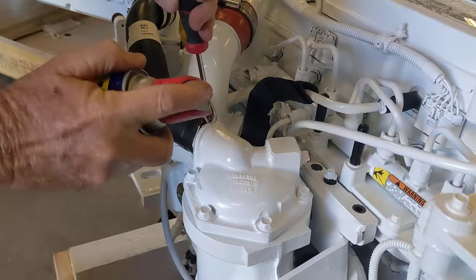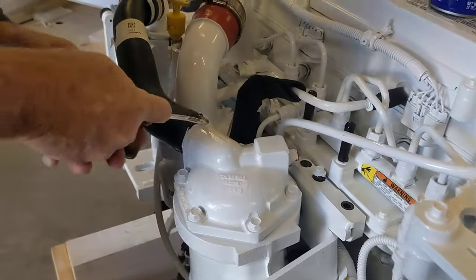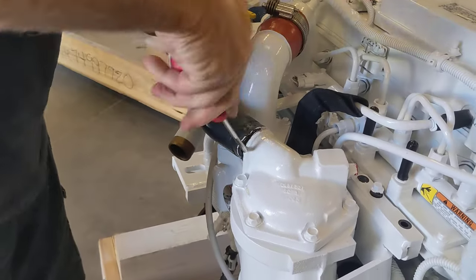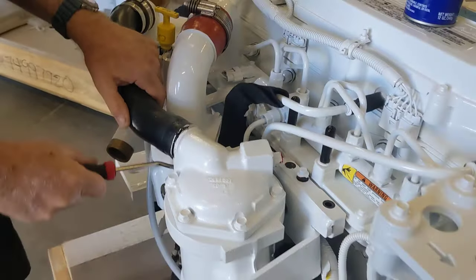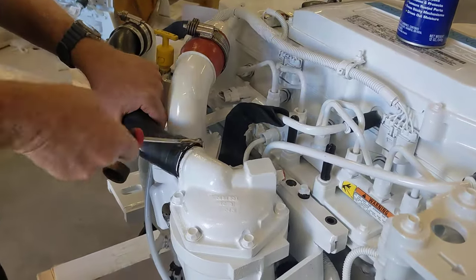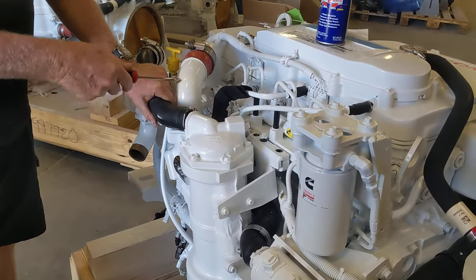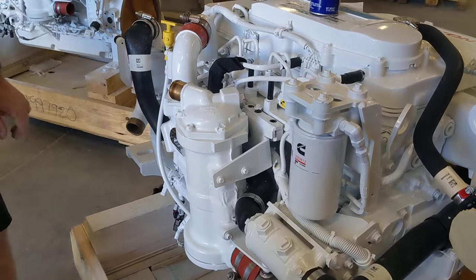This is one of the reasons I always tell people to put these air hoses on dry, and also air filters. Put them on dry because they really will stick. If you put them on with Rector Seal or anything, they can pop off because there's so much pressure. It can be up to 30 PSI. It's a big hose for 30 PSI. But if you put them on clean and dry, the rubber really sticks to the metal. So if you squirt a little WD, you can work it around them, and then that'll come off. Tuck that out of the way.